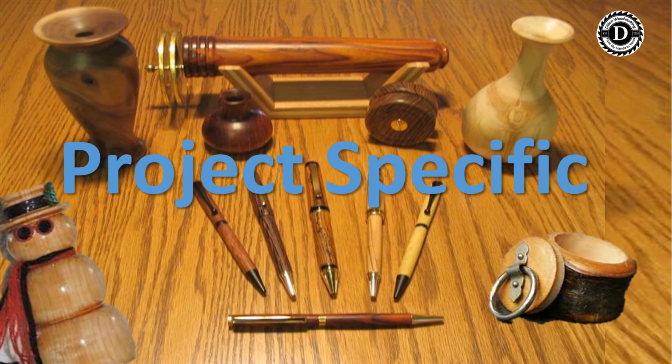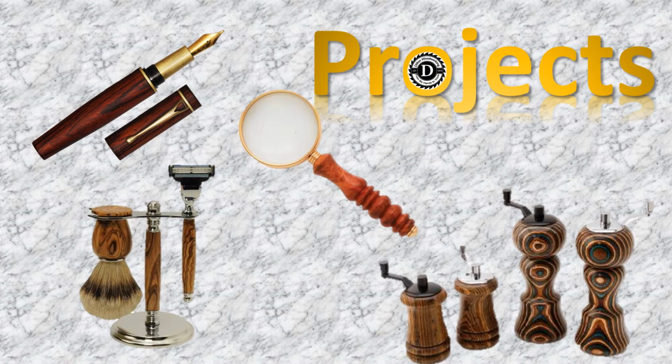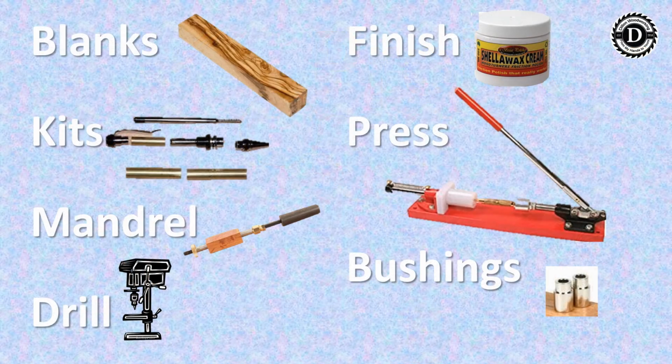There are also many different types of things that you may wish to purchase or create depending on the specific project you want to create. For making smaller projects such as pens and shaving tools, you will want different types of woods referred to as blanks, a kit to put together, a mandrel to hold everything together between the centers, a drill to make a hole through the middle of the blank, finish to give it that nice looking sheen, a press to put them together, and a bushing that guides you on how small or large you want your project.